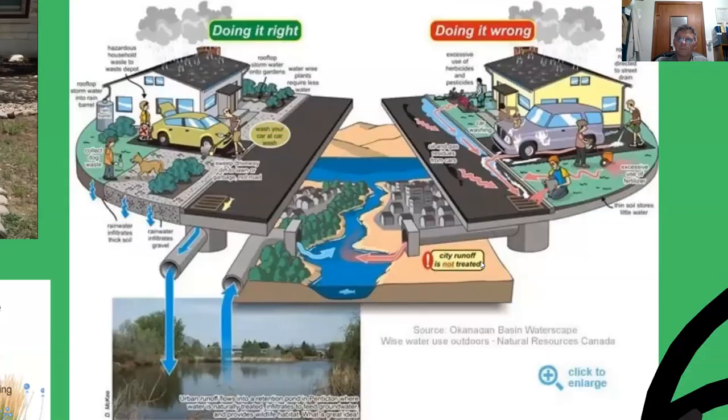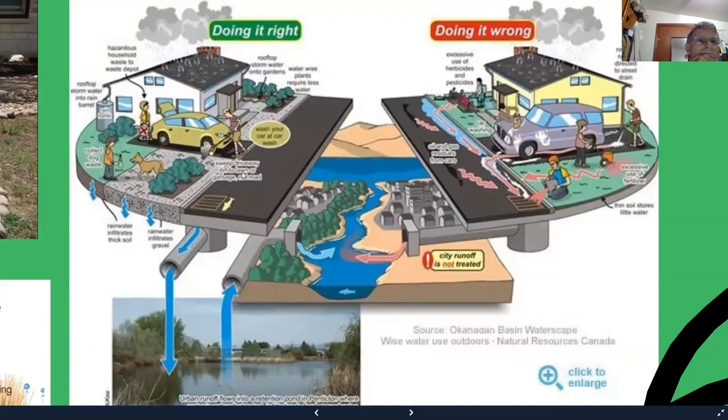If you're really doing it right, you're going to have tanks to catch that water and infiltration beds with thick soil where you can sink that water into the ground so that none of the water from your land gets to the storm drain — unless it's a huge storm event. You caught three inches of rain and then that fourth inch ran off into the street — hey, you did great. But most of the time there's no space for infiltration and people are just letting whatever go down the storm drains, including oil and gas dripping from cars and leaves that block drains.